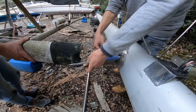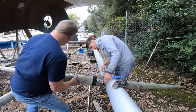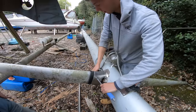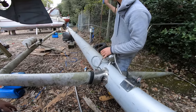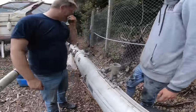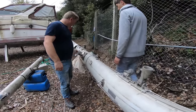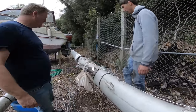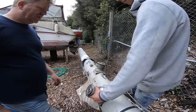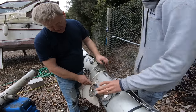Just pull the cable through - a bit of water coming out of it. We'll just test these spreader lights as well, see if they work. The cables are all pushed inside the mast. Did you check any of the sheave blocks set into the mast to see if any of them are jammed? None of them are perfect but they are all spinning. They could all do with a service. Same with the winches, they're all a little bit stiffer - they all need a service. But they work. Somebody's actually stolen one of the winches off this mast here.